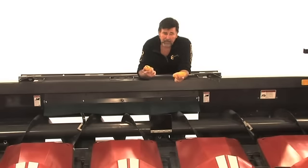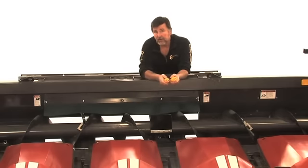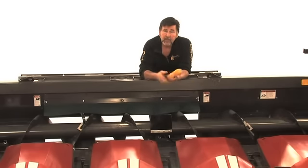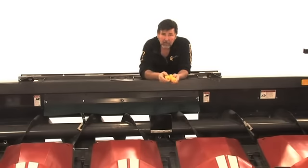When corn gets dry, the surface gets much slicker. This makes it much more difficult for the feeder house to take the corn away from the auger and take it up a steep incline called the feeder house. Now remember, when we harvested corn that was 28% and put it in a grain bin, you could crawl up in that grain bin and walk on it like a sidewalk. When the corn was dry in that grain bin, you'd sink to your knees. That's because the surface of corn gets slicker as it gets drier. Same way with two ears of corn. They don't push each other as efficiently as when it's wet.